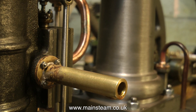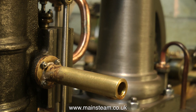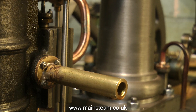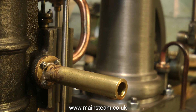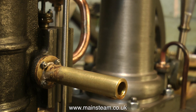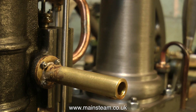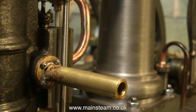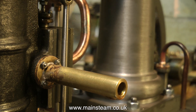This is also not correct, and it's quite serious: the piston seems to blow. Compressed air is leaking past the piston, so there is no power whatsoever in this engine as most of the air is just blowing past. Also, the slide valve may not fit very well on the port face — I can't comment further on these two points without dismantling the engine fully.